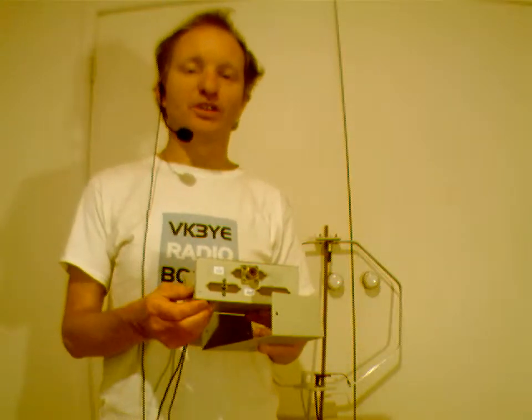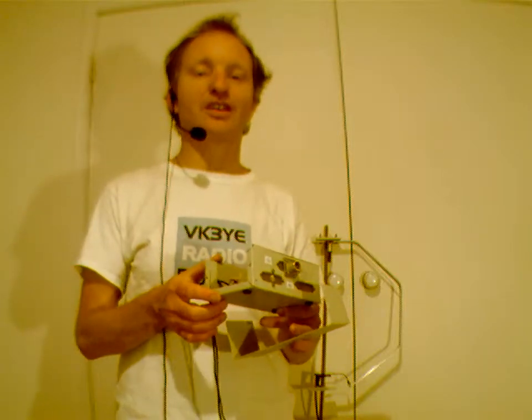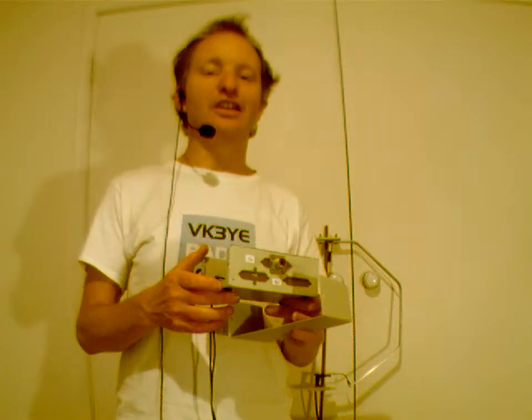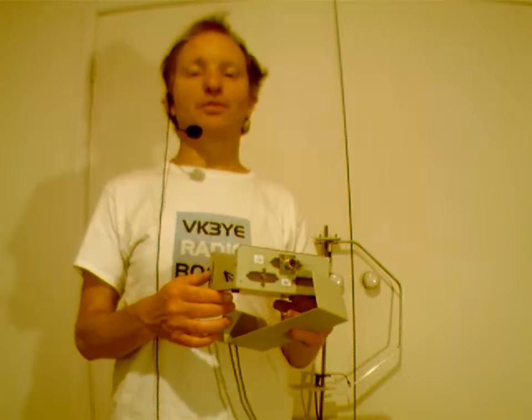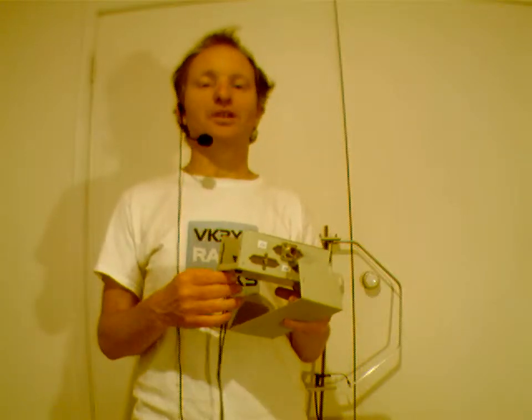Now, you might think digital modes are pretty boring. Modes like WSPR, it's a great beaconing system. You can leave your transceiver to do its thing. Then there's FT8, where again you are having a very rubber stamp exchange. It is sort of a contact, but you're not able to chat freely. Well, JS8 is a whole lot better than that. It's a bit of a hybrid. It reminds me a lot of slow speed CW, like 10 or 12 words a minute.